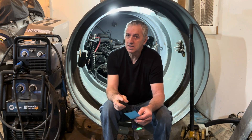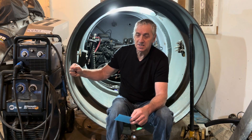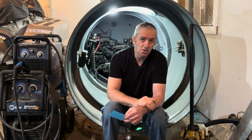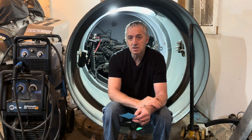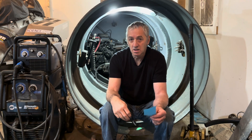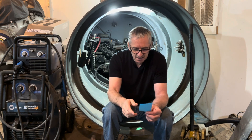One thing that's really nice about this tank is it was much bigger than what I needed. The excess steel is what I used to make the conning tower and the nozzle for the conning tower. I cut two big strips of steel out of the hull and then bent it in my 50-ton press to make the conning tower and the nozzle. That ended up being just a bit of time and some propane.